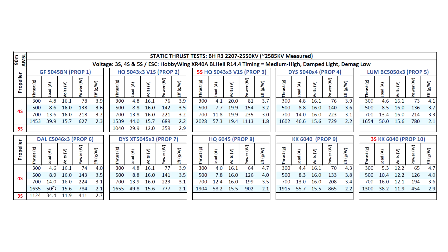50 amps and 49 amps - you've got to keep in mind I'm running static thrust using a power supply maintaining voltage at pretty much 16 volts, so the motors being static just draw all this juice. This is just the momentary max - that's how I do all my tests so we can compare motor to motor. On the 6-inch prop, it almost didn't quite reach the 2kg mark but cleared 1900 pretty easily. And even on 3S, pretty respectable numbers on 6-inch if somebody wants to run this on 3S.